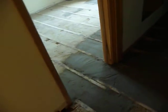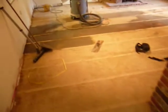So what we're going to do is epoxy barrier the whole floor. We're not just going to do the area that was affected by the leak, because the moisture will have tracked under the floor. It will be in the concrete, which is beneath the polystyrene, and it could track across the floor. So if we just blocked the area that had the leak, the water could track across and come up somewhere else, therefore damaging the new floor covering that we're going to put down, and obviously nobody wants that. So this is the first stage.